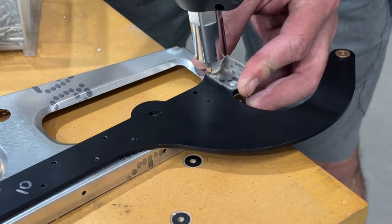I got all the safety wire done for all of the bolts holding in the flap bell crank and aileron pulley mounts — those all turned out pretty nicely. I drilled two millimeter holes right in the end of the rib and was able to safety wire it nicely. The control cables for the aileron are running through the block. For now, I just coiled up my Teflex cable and aileron control cables out of the way.